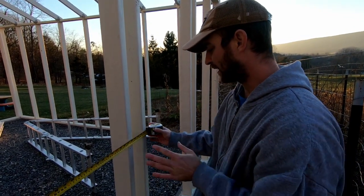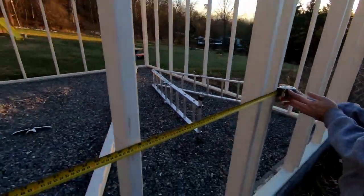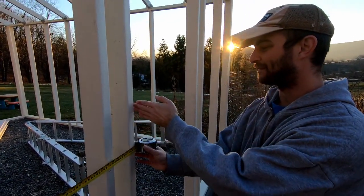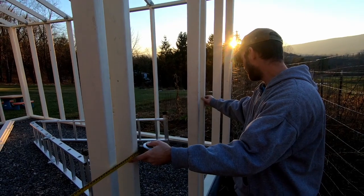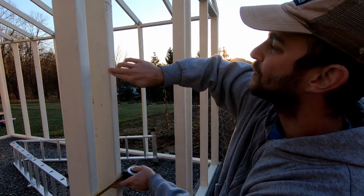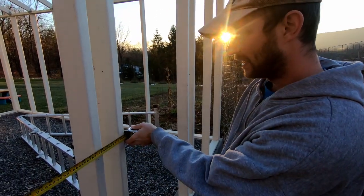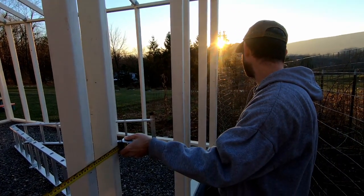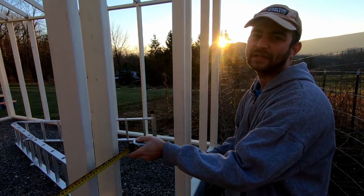You have to be careful because every board has one tongue and groove. So if I cut a piece vertically, because I need the tongue side, it's gonna have a flat side over here. The other piece is gonna have a flat side and a groove side. So that might work out perfect where I literally just split them up, because it would be nice to have a flat edge up against the door here, and not a tongue or a groove. Long story short, we could take one final board and cut it in two. Half of it is gonna go on this side, the other half's gonna go on this side, and the center area is where I have to custom fit the last piece.